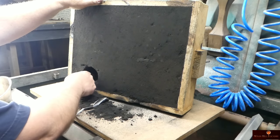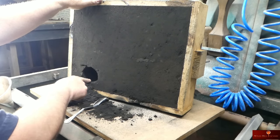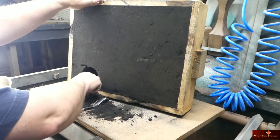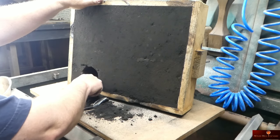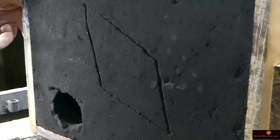That's a nice size cup. That'll keep anything from aspirating. I'll be able to keep that cup full and not let it starve for iron. Just so I don't forget which mold is which, I'm gonna turn it the other way.